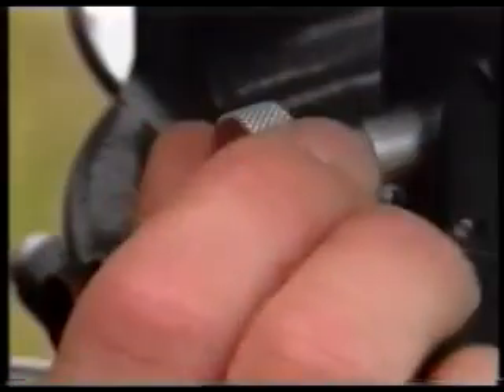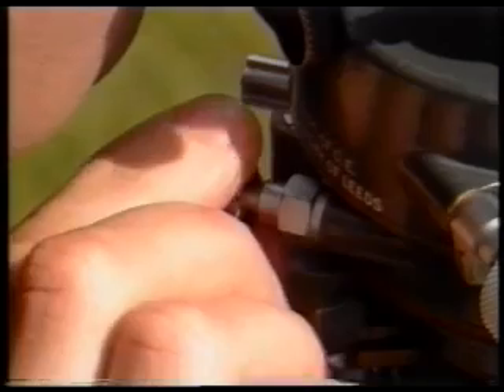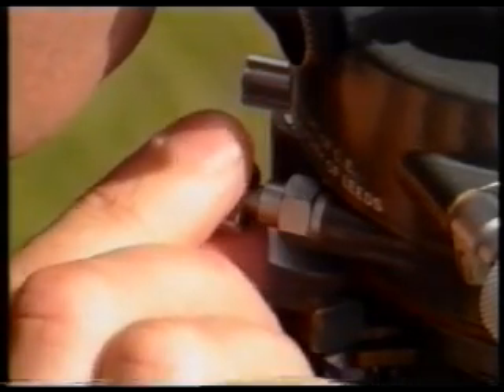Now that you have eliminated parallax, use the vertical slow motion screw and the lower plate slow motion screw to make the vertical hair of the diaphragm pass through the nail in the top of the reference object — in this case station X. Don't bother to make the centre of the crosshairs pass through the top of the nail; this wastes time. However, it is important that roughly the same part of the vertical hair is used each time an intersection is made.